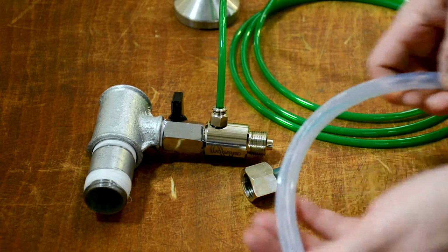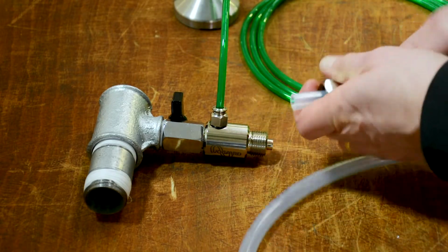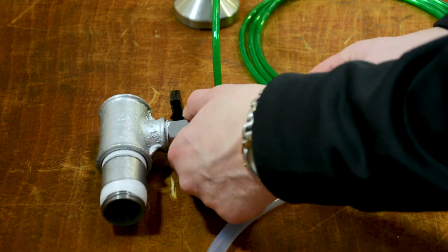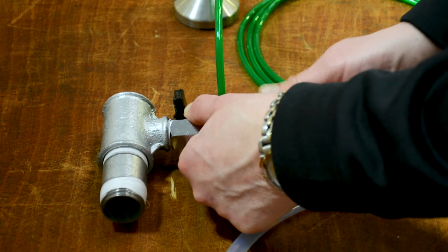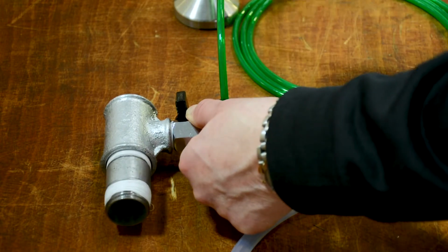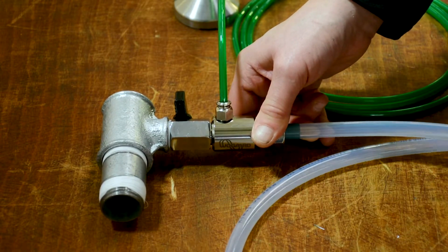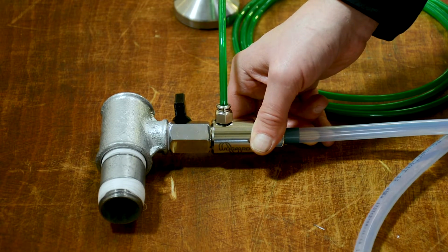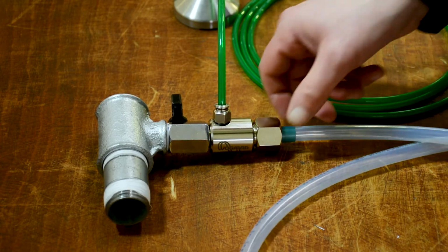Okay, and then we have the outlet pipe, which is this one here, and this would fit inside the nut here, and then we tighten up to the compression fitting there, and once that's fully pushed up, we tighten that up again until we're nice and tight to a stop, and then tighten up with a spanner. Then this outlet hose is the one that goes straight into the sump, so the important bit is that we keep it nice and straight and directly in the sump and avoid any curves. And we don't recommend cutting it any shorter than 150mm, because this all helps with the action on the oil saver.